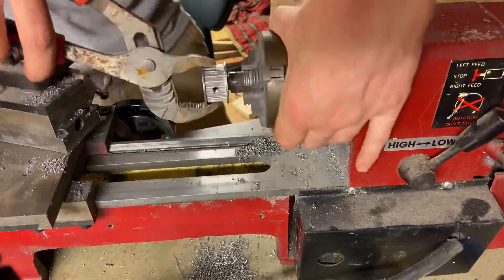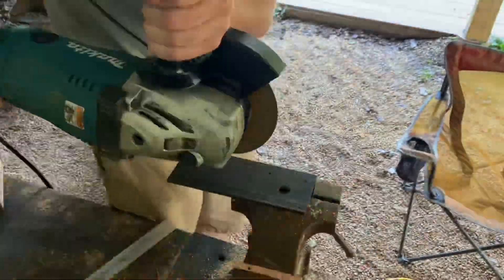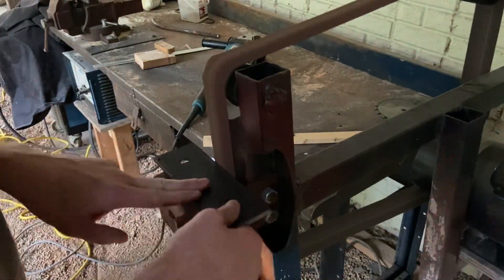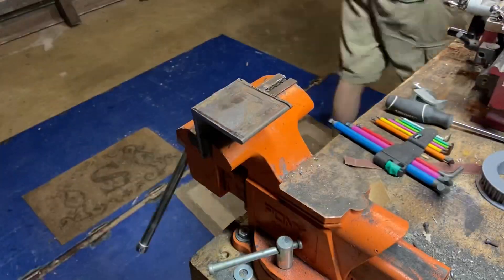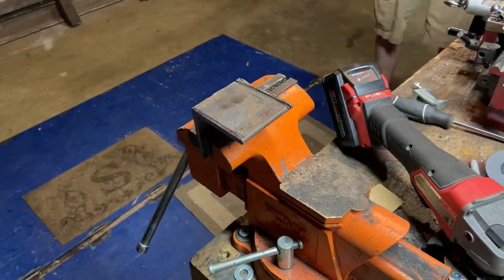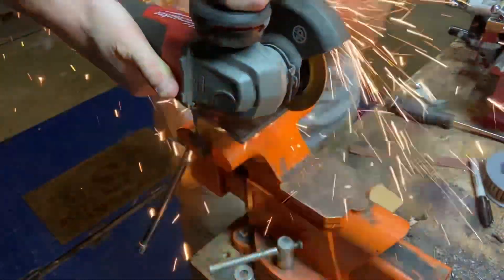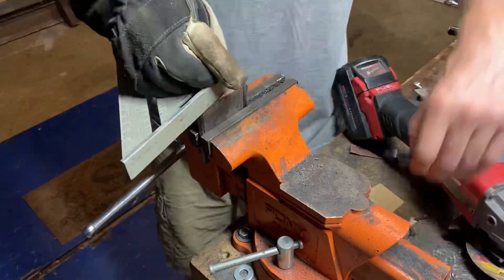I figured before I put this video out I'd at least have one more thing done, so I wanted to go and make the mount for the stepper that's going to go to the main lead screw, especially now that I've got that pulley. Here I've got the plate that I actually cut in an old video — you can see it's got the five holes in it where the stepper is going to mount to. I cut it to size and used the belt sander to trim it up a little bit. Now I'm trimming a piece of angle iron that's actually going to be epoxied to the side of the lathe. Using that other plate, I'm going to have a little bit of a hinge action so I can tension the tooth belt between the stepper motor and the pulley I just was working on.